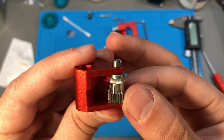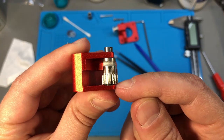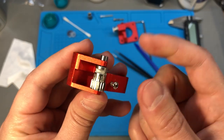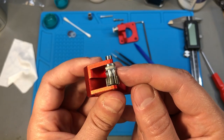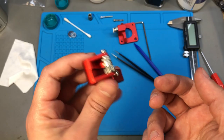There is however some vertical play left in the system, and that's mostly due to the grinding that happened on the bottom mounting surface, which increased the tolerance. I could fix that by introducing a washer as explained earlier, but first I want to see if it's really necessary or if it's running just fine as it is.